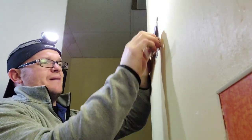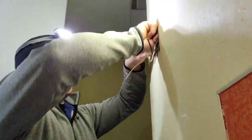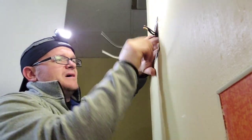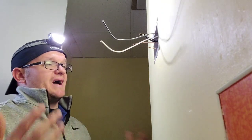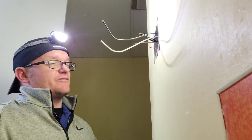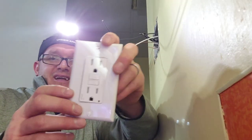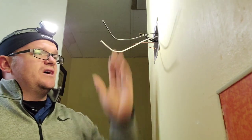I'm going to have my switch on the left-hand side because that side is closer to the sink, and the GFCI receptacle will be on the bottom. Now if this were in any other location, I would need AFCI protection, but the bathroom is one of the last places where you do not have to have AFCI protection stemming from the panel. However, today I'm going to install an AFCI/GFCI dual-function receptacle just because I love the technology, although I'm not required to do it.